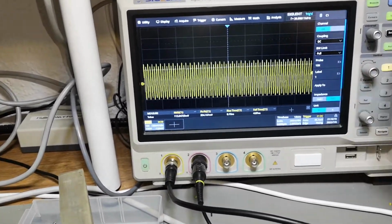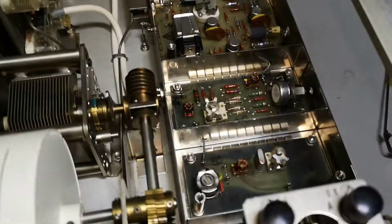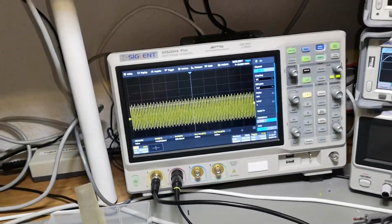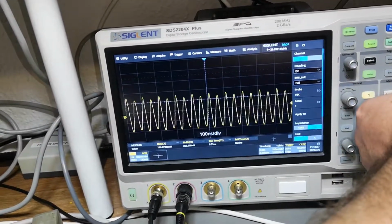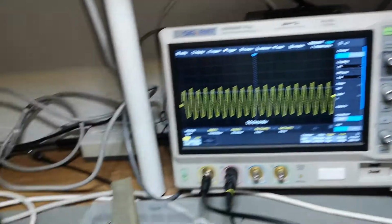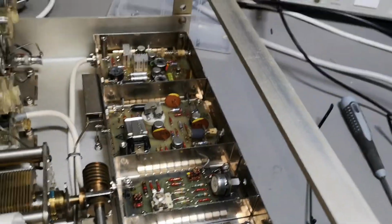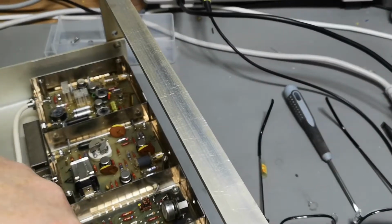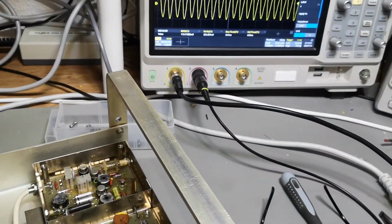There's actually a 40 megahertz. This is of course a signal that is not supposed to be there. I think we should just adjust this system right here, and then this will probably be completely gone. And this is not intended. You see? So this is of course the oscillator that is leaking through this crystal filter. I bet if we take something here and even just touch.